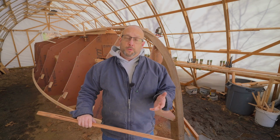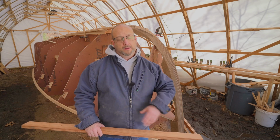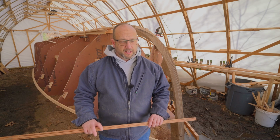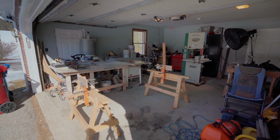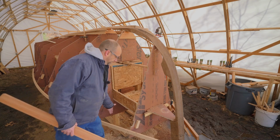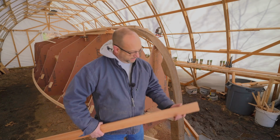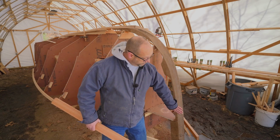So I think what I'm going to do is take these 30-foot long pieces of lumber back over to the shop, prop them up, get them nicely supported, and set up a nice tight blocking arrangement at the bandsaw. And I think I'm going to make 2 cuts instead of 3. And I think those 2 cuts, just for the first station and a half, maybe to somewhere in this vicinity back here, is going to be enough to allow for the twist and the bend that's most extreme right up against the stem.